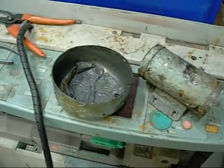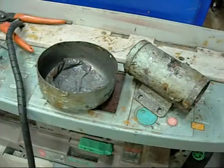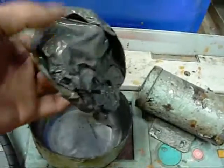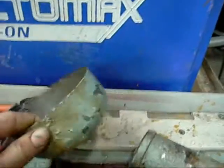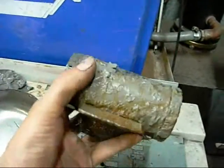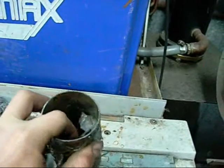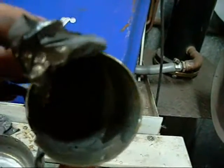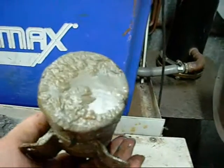This is the capacitor housing and centrifugal switch housing for the Brook electric motor, straight out of the electrolysis system. This plastic-like film on the inside is actually the paint from the inside of the housing. All it needs is a rub down with Scotch-Brite and a dry in the oven and she'll be right. Electrolysis generally needs line of sight to clean things, although it seems to have penetrated the inside of this container pretty well, with some areas not so well.